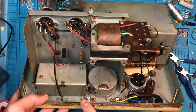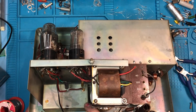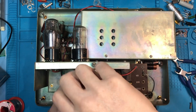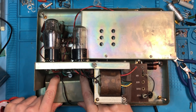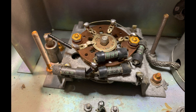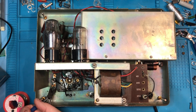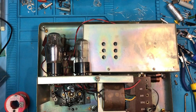Here you can see I've replaced this one, this one, and I've got to replace that one, but the next one is under this shielded metal box — this is the attenuated RF socket under here. So let's get the top off the cover — just a couple of nuts to remove the cover. I've already desoldered that wire from the front panel connector as that's going to get replaced in a moment anyway. So you can see here we've got the multiplier pot and the black wire going to the attenuated RF socket on the front of the case. To remove the socket we've got to take nuts off these very long bolts which go all the way through and secure the top of the metal cover, just using a flat-headed screwdriver on the front of the case.